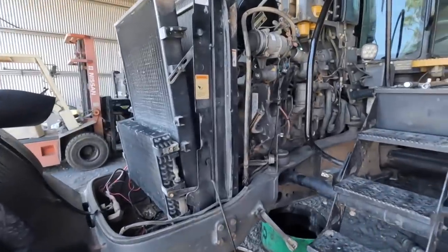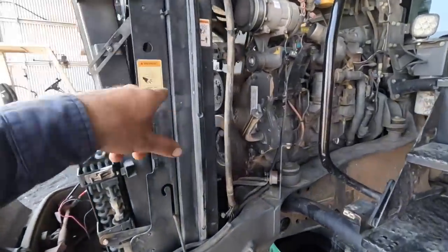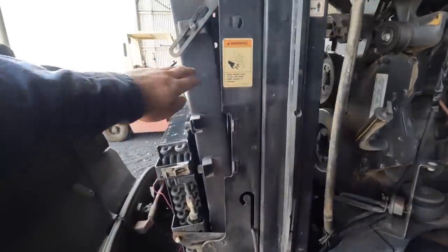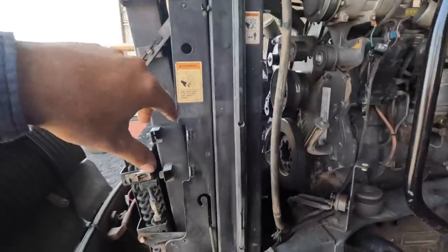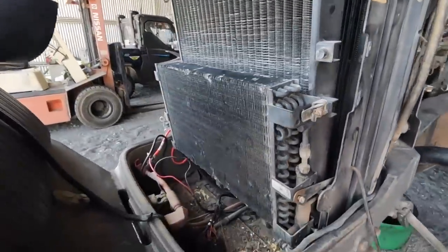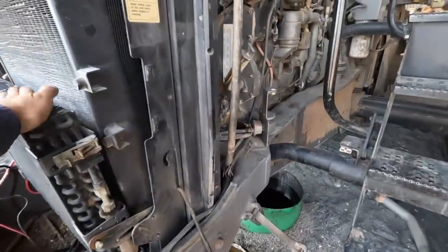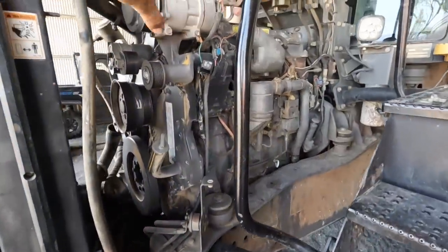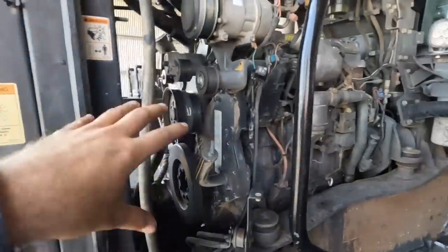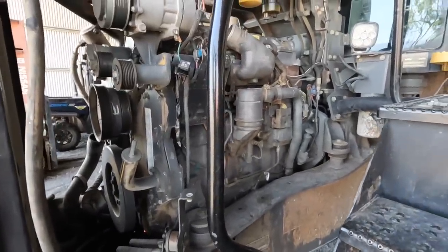Well, morning tea time. We've got a decent amount done. We were hoping we could pull the radiator out and then get to the bits under there that we needed to get this oil cooler out, but it looks like it's going to be trickier. So we've probably got to drain the hydraulic oil so we can undo the fittings under there. We're hoping to leave the air conditioning system intact, so we'll pop the compressor off, and once the radiator's out, we can set it down here. Then it's just a matter of getting the motor out from that.